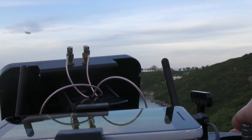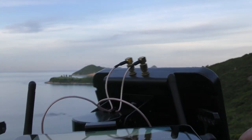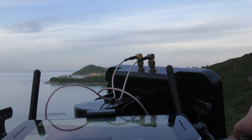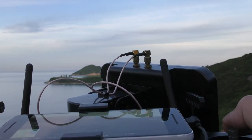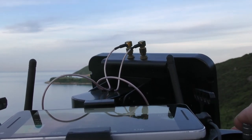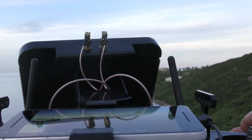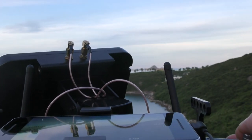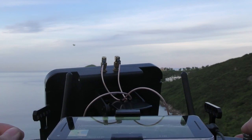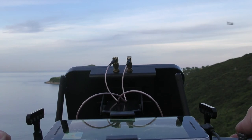But don't just look at the range of the system. In all the flight test videos, I was not flying blind during the whole flight. In every moment, I knew all the details — where the drone was, the drone battery level, the direction to fly back home, exactly how well the drone was receiving my control data, and how well the ground station was receiving the FPV signal. I knew when I had to fly back and where I shouldn't fly close to. When you know the real-time situation of your aircraft, you always know when something is going wrong and can do something to correct it. Even if you fly in manual mode, you can avoid a crash in most situations.